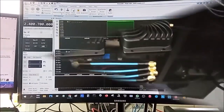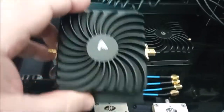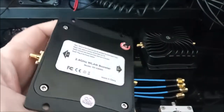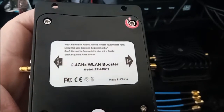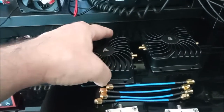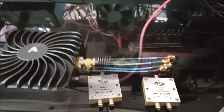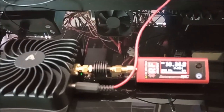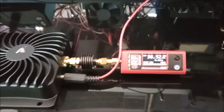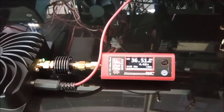Here is the equipment that I'm using. I'm using this splitter/combiner purchased from eBay, very cheap - they are rated up to 20 watts. This is the first amplifier, with some specs on the back, and a few good quality SMA jumper cables. So let's test the first amplifier to see how much it will provide. It's about 36.5 dBm, as you can see on the RF power meter, feeding it with 12 volts DC.